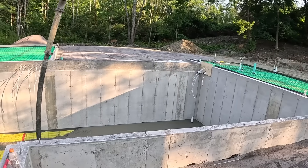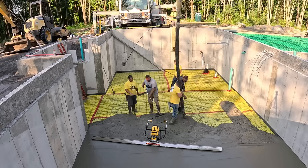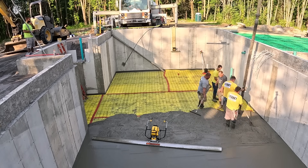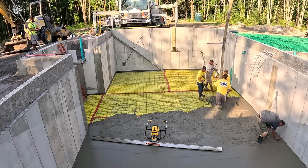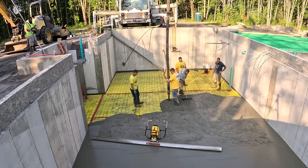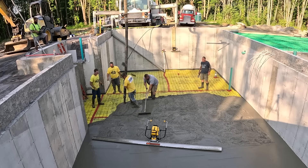I'm going to get you around to the other side of the house foundation. This is just a residential house in Portland, Maine. There's this little back piece I'm going to show you how to use the Mini-Me power trowel to finish. And then there's a 2 or 3 car garage over there — that's where the pump truck sat up. He could reach everything really easily from there, and we're just dangle pumping the concrete down inside the basement. The basement floor figured around 16 yards of concrete. A pump truck where we're from charges about $1,100 to get here for 4 hours.